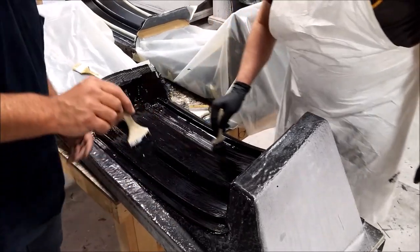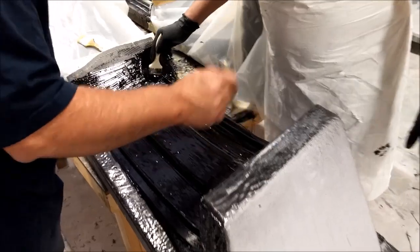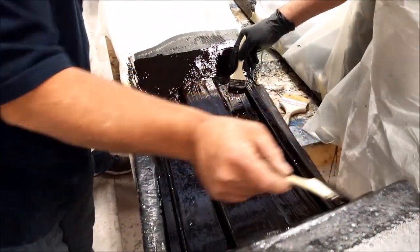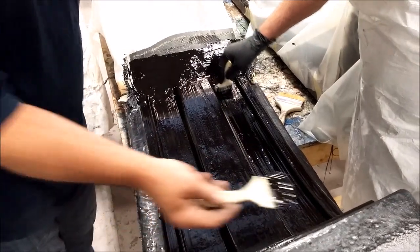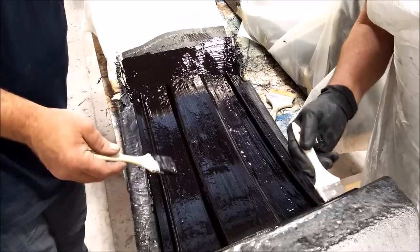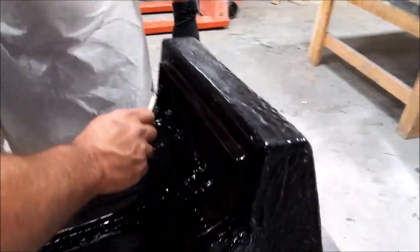The next thing was to finish off the floor braces — again those are a two-part mold. Here we are doing the second half, with the little flange board that we're working up to. We're putting down the black — what I like to call the black goop — it's kind of like tar, really sticky and messy, but that's basically the gel coat that goes down first.